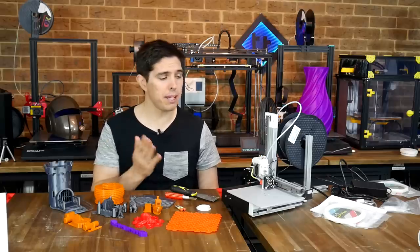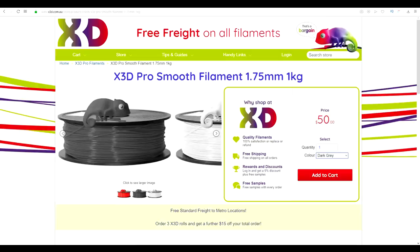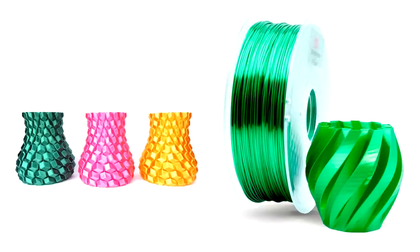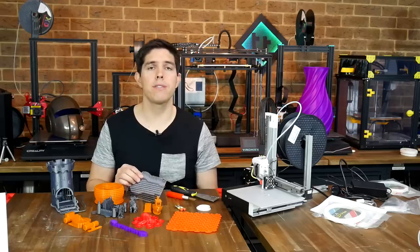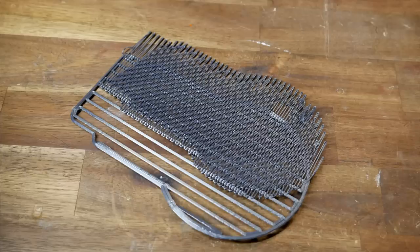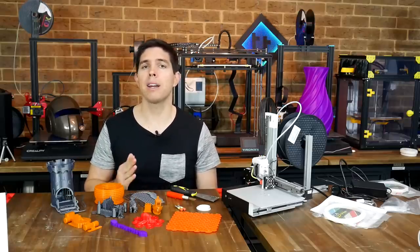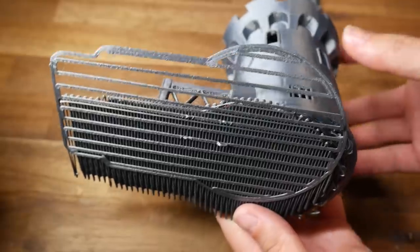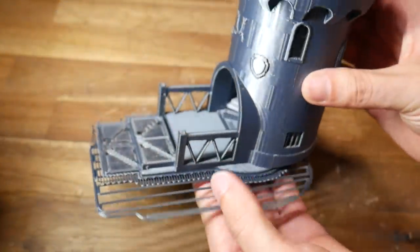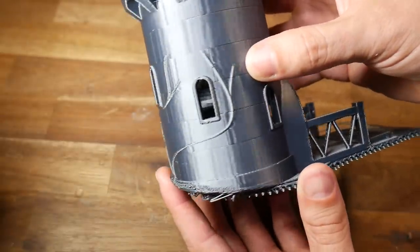I was keen to print something fairly large relative to the print volume, so I picked out a dice tower, and selected some X3D Smooth PLA, which seems similar to the Poly Alchema Elixir filament I've seen in other videos, but locally available at a reasonable price. On my first print, it experienced a layer shift while doing the raft. I stopped it, removed it, started again, and the exact same thing happened. This time I let it go figuring it would correct itself, and it did for the most part — though one edge wasn't supported, making the raft a little mangled and difficult to remove. The overall shape is there, but there is pretty severe ringing over the entire print, with additional layer shifts up at the top of the castle.